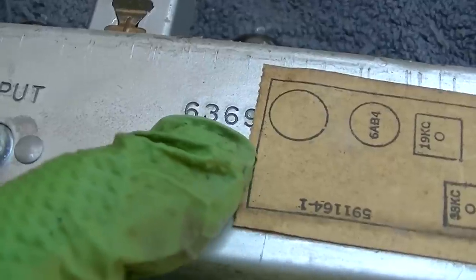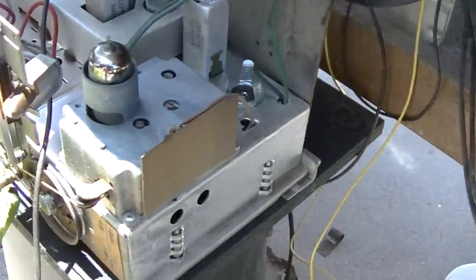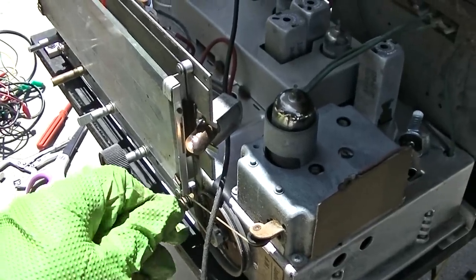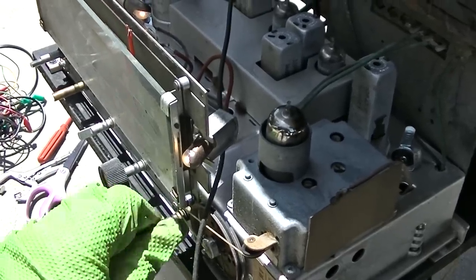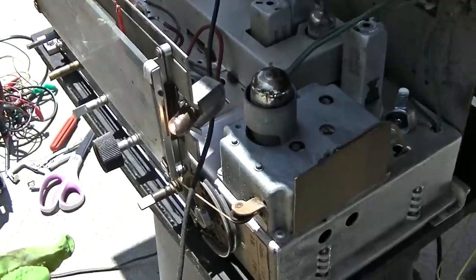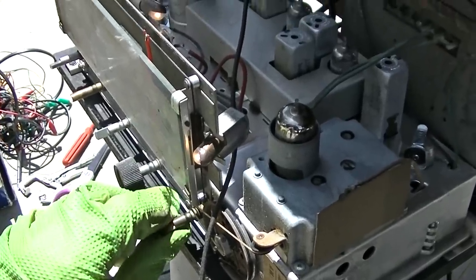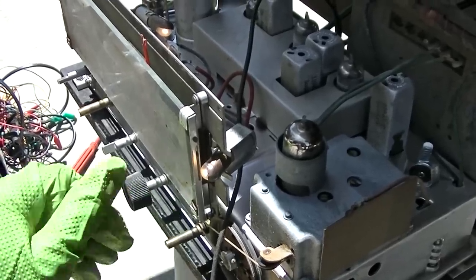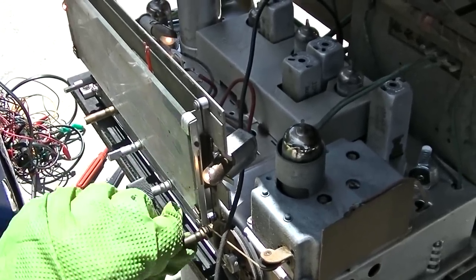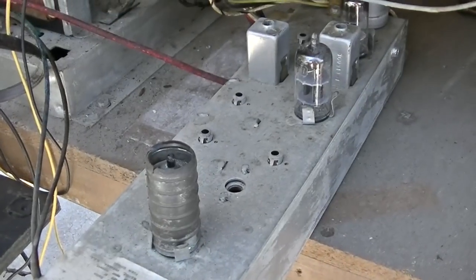And I'm reading this as the 69th month of the 63rd year. So this is from 1963. So yes, now when I tune to FM multiplex, I'm getting the full signal through there, not just the separated stereo information. So this is on FM multiplex. That's regular FM. So yeah, big difference now with that 4 microfarad capacitor in place.